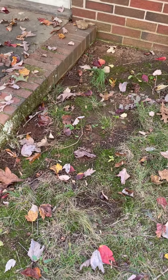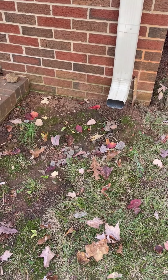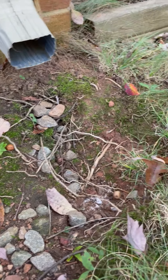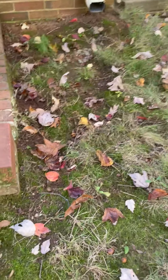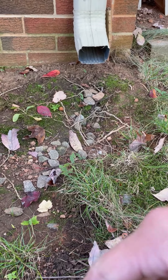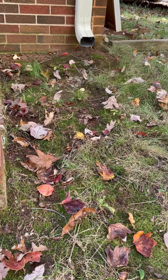We're going to use three-quarter river rock in conjunction with some mulch in your flower beds to take care of that issue. We're here at the corner of the house — you can see our large five-inch diameter downspout coming down. You can see over time where it's created this huge divot where the water has been hitting the ground and running out and away from the house. Over time this causes a lot of erosion, and this is a really easy fix.